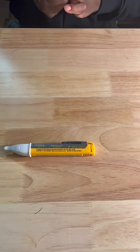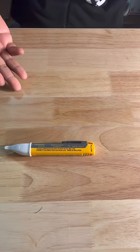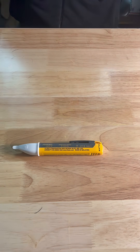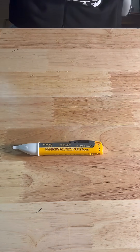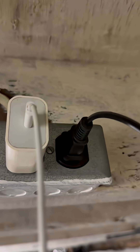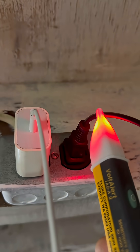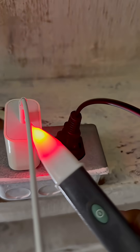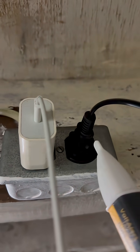So we're going to start with the Volt Alert. It can be used for various things, but what I use this for is to verify if the power is on or if the power is off on a certain device — if there's any current going through the device, if it's a live wire, if there's electricity there and the electricity is hot. It's pretty simple to use, it's a nice tool made by Fluke. What we're going to do is hit the green button right here. You should hear that noise and that beat. Then we're going to just touch the wire. If the wire is live, you'll get the red beat. This should tell you that there's live voltage and you shouldn't be playing with this.